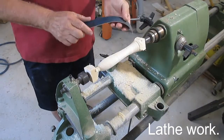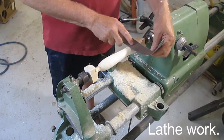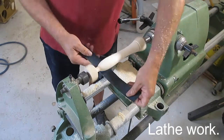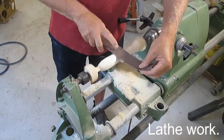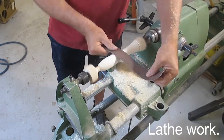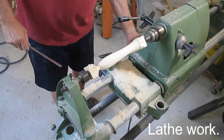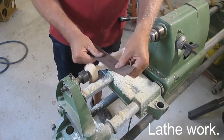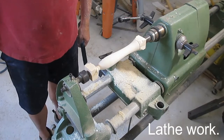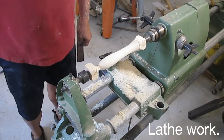We're ready to start with some sandpaper. I've got some 80 grit. One of the things you've got to be careful with 80 grit — don't push too hard because 80 grit will leave scratches, and you'll have to sand off a fair bit to get rid of those scratches. So fairly lightly. I've moved up to 120 grit and we'll do some more. It's looking really, really good. We're going to do a tiny, tiny little bit with 240 — and that's all the sanding we'll do at least at this stage. This is actually 220 grit.